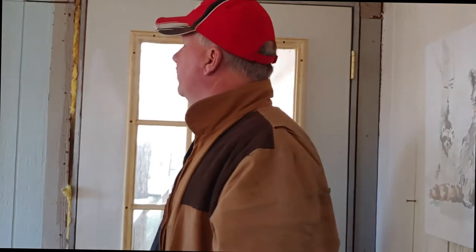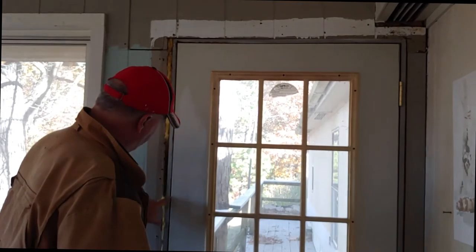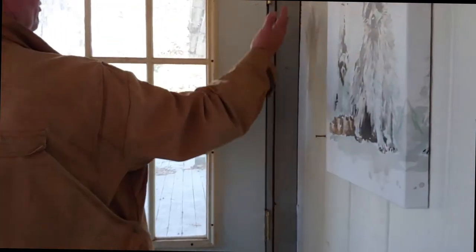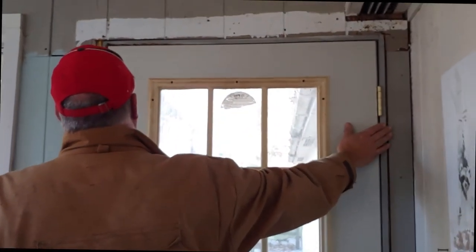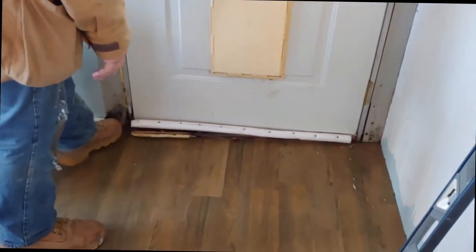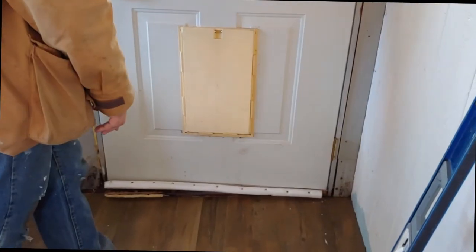Good to have you here. What we're doing today is replacing doors that we put in a while back. They were put in wrong, evidently, or they became out of square. You can see where they took a chisel and chiseled out and sanded. But you see this gap over here? It's wider than down there — tilted over — so they still just needed to go a little lower, so you keep that gap all the way across. Instead it was rubbing over and they had to chisel that out to get it to close. But now it's been leaking so long they rotted out the 1x4 trim at the bottom of the door. So we're going to replace this door.